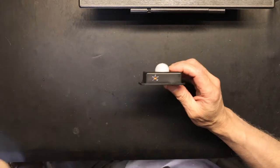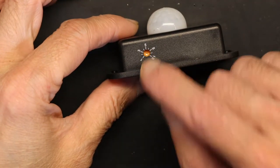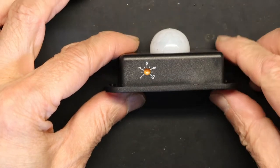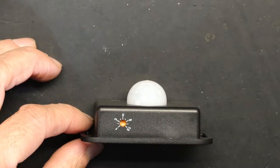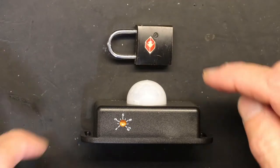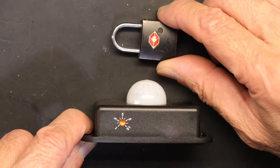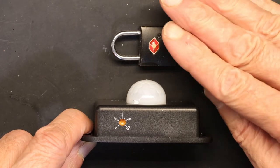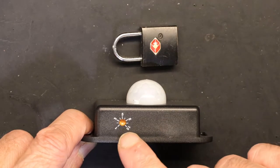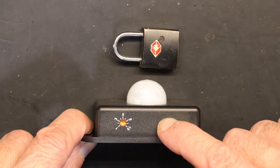The employee has to turn it off manually. There is a duration sensor on this unit — let me show you a close-up — this duration sensor determines how long the activation stays on. When a vehicle comes through and stops, it's not producing any more motion because the driver has pressed the brakes. So if the duration is set very short, as soon as the vehicle arrives and stops, the activation will end and the headset will get disconnected.